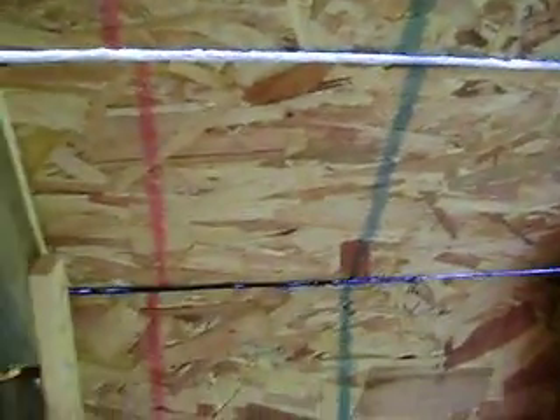On this roofing section, these were four-foot pieces of OSB plywood — really cheap stuff. These are three-foot sections, so I cut a foot off each piece and then nailed the additional feet together for this piece here, which should be just fine.